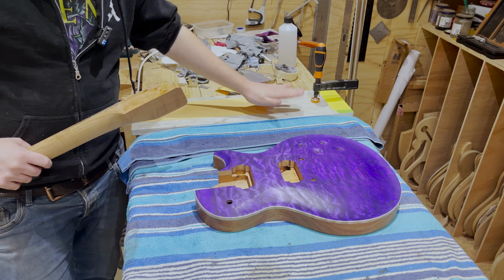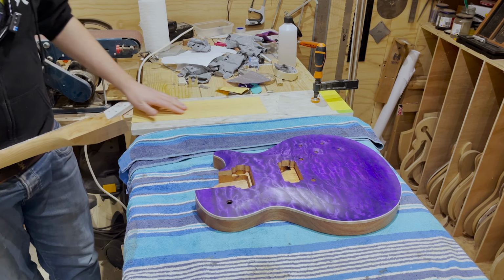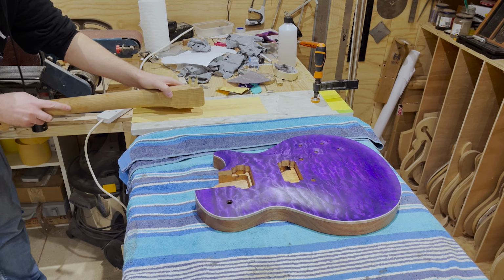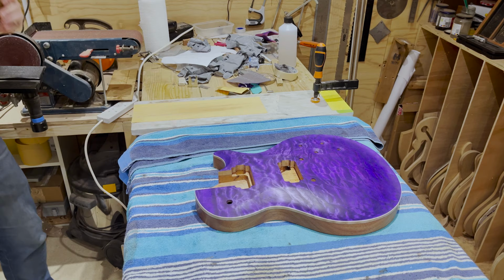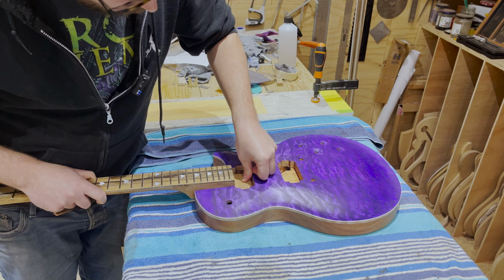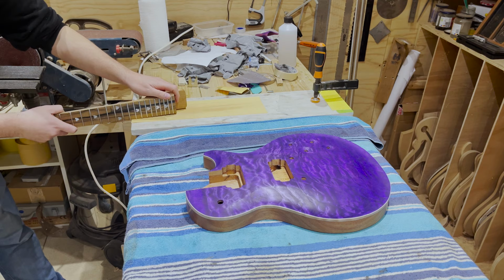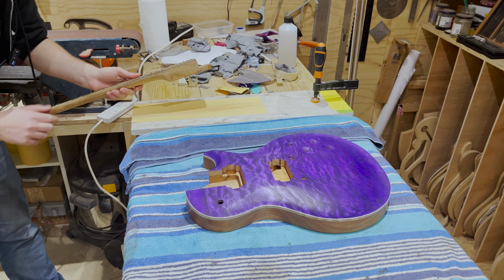I've got a straight block of marble here, anything straight will do, and this is some 120 grit sandpaper that's fairly well used. And what I do is take even passes on both sides, like this. And then we will give it another fit. So I can already feel that goes in more easily, but that's still a bit too tight. So we're going to come back once more. And notice how I'm sanding all the way down the length of it. That's because we don't want to push the taper in, because it will be noticeable if we have to take away a lot of material.